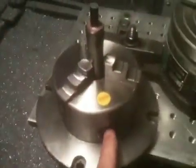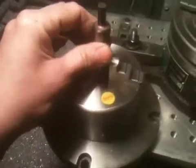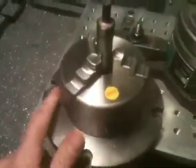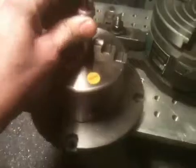You don't necessarily have to tighten up your things there, because it'll actually pull it up a little bit as you tighten them up. So I just drop it down in there so it's not going to wobble around in any direction, and then just tighten up the clamps here. I have T-slots that I had made. I made T-slots for this table. You just tighten up your T-slots then. And the same method applies. You just verify that it sets in there freely once you got it tightened up.